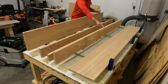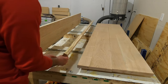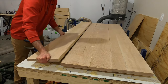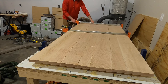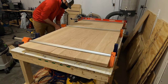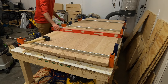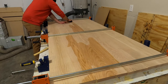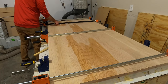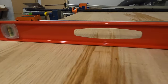To get this top re-glued back together I went straight back to my old method — just putting the glue on the seams, laying the boards down, and then clamping across them on the bottom and the top. A long time ago I used to use dowels on each of the seams to help for alignment and I got away from that because of how much time it took, so I'm not really sure why I even thought I should use dominoes here. When you know something works you really don't have any reason to go against that and try a new method, and that's exactly what I'm doing here by going right back to how I normally glue tabletops up — using just clamps and focusing on the glue seams on top to make sure everything is clamped very well together.